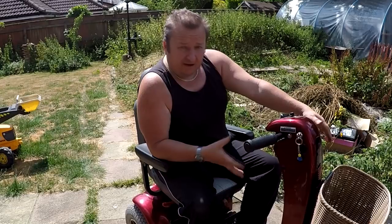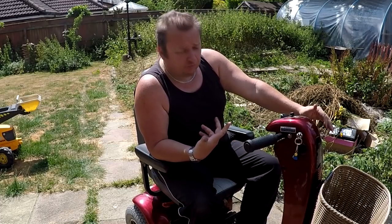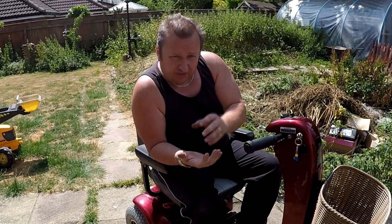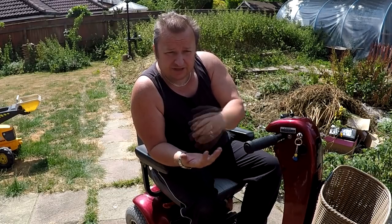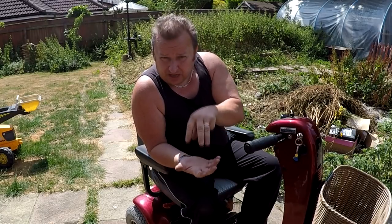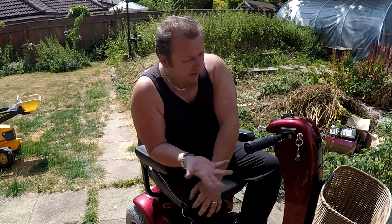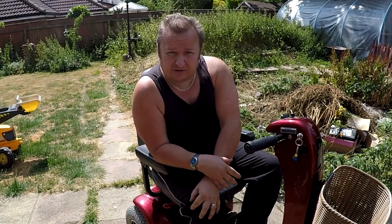We've got no electronic brake functioning at the moment — although it's connected to the circuit and registering as faulty, there's nothing more I can do right now. So I'm going to order up a new electronic brake. Hey presto — problem solved. We know we're getting 24 volts to the electronic brake, so it's obviously a fault with that unit. I think the internal coil core may have come adrift inside the body. I won't know until I see the new one. I'm calling the job done. Hopefully if you've got one of these scooters with a similar problem, this video will help you. Thanks very much — see you in the next video.